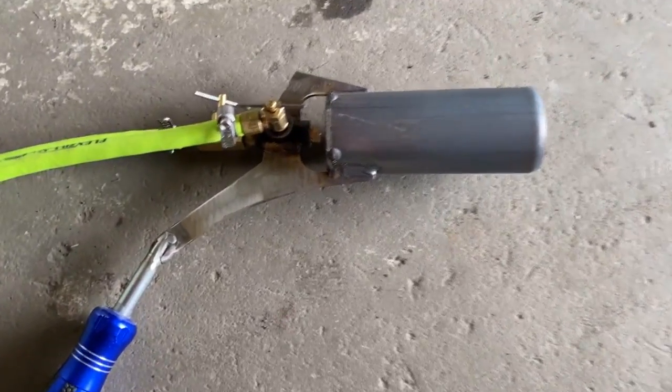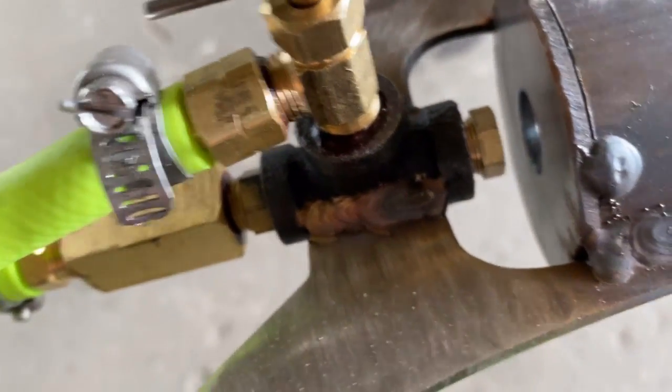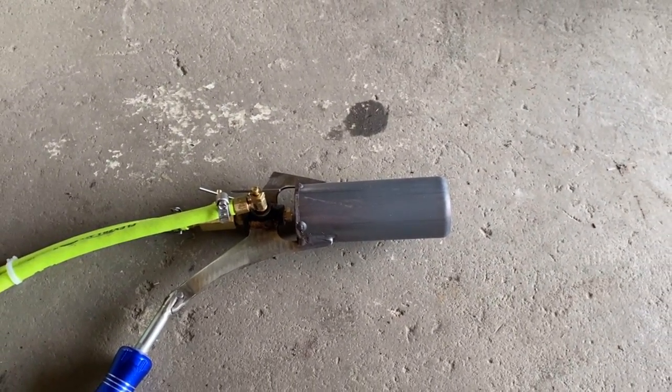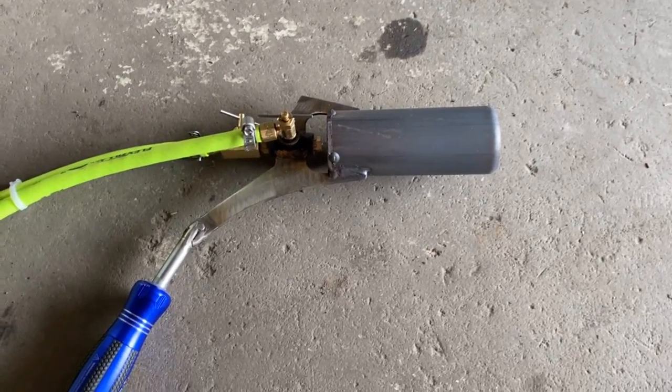Here's a closer look at the gun. I'm going to be doing some modifications to this nozzle today — we're going to bore out that tip a little bit and see if we can get this thing to run a high-velocity flame in the 100 to 120 kilowatt zone.